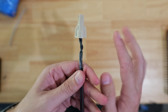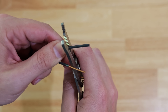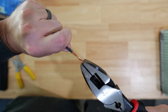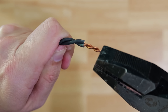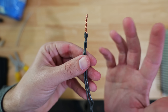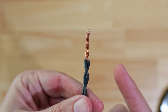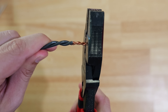What a lot of electricians will do is they'll strip just a little bit more insulation off than you normally would, take their lineman pliers, and do what is called pre-twisting. The reason they do this is they know it's going to form a nice tight joint so those wires are not depending on the wire nut to hold them together. You know you're going to have plenty of surface contact between the wires, and by doing this before putting a wire nut on, they're able to verify that they have a very tight bond — then they'll just cut off the top.